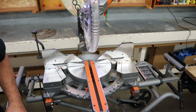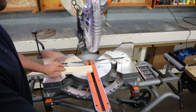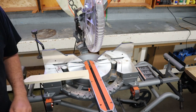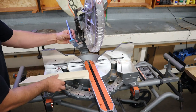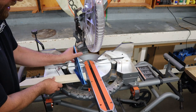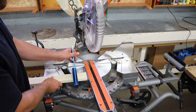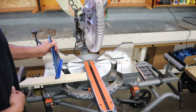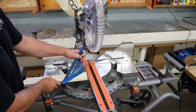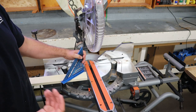But there are a whole lot of other cross cuts too. If I was to swing this saw around, I could get a whole lot of different angles. What would be happening is the blade comes down to cut at a different angle. All of those are technically cross cuts. Anytime we cut across the grain, whether it's a straight 90-degree cut or some other degree, all of those count as cross cuts. That's where the miter saw excels as a tool.